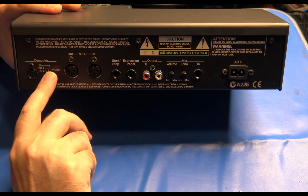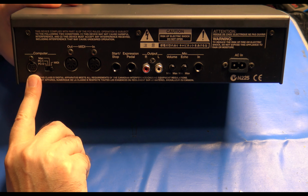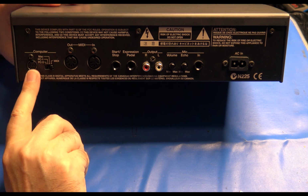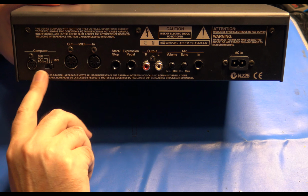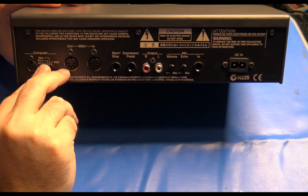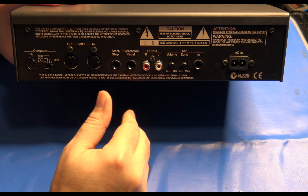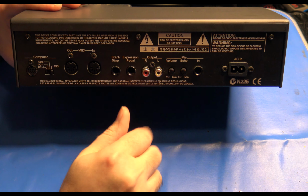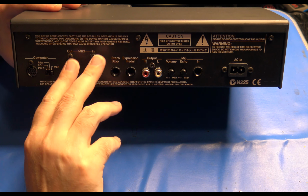And then over here, to the far left, we have a little slider switch that goes between 4 different positions and has basically an 8-pin mini-DIN connection. This is actually a serial input connection to connect it up to a PC. So if you had the right kind of cable, you could actually connect the module up to your computer and then select between the different PC types or even Macintosh to be able to interact with the module using additional software on a computer.